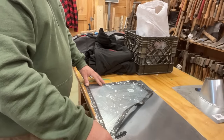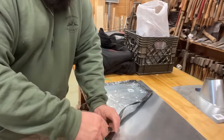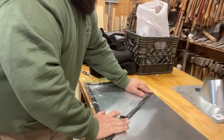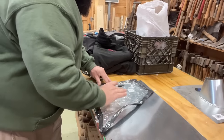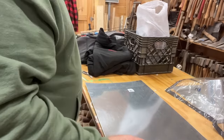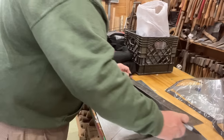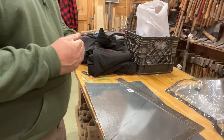The window was packaged all year so it needs to be stretched out. I'm going to pull it, stretch it out to right there, and put a mark with my marker. I can't really trace it right now because the window is making its own form, but I can put it flat, stretch it out, and trace it. Same goes for this side — so I have all my angles traced out from the window. Then you can take a straight edge and just finish up your lines.